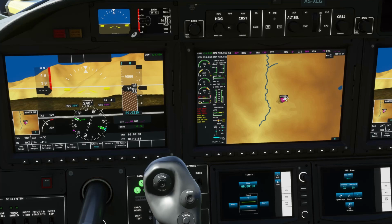That's the time we will move from low idle to flight idle, all the time monitoring the ITT temperatures, because this is not allowed to be at, say, 870 degrees for more than 20 seconds or 1000 degrees for more than 5 seconds. Alright, so it shouldn't get that far, but it's important to monitor it. Okay, and it's also important to have a look at the oil pressures and oil temperature.